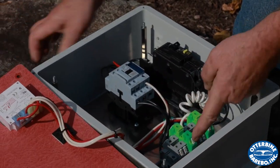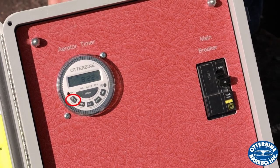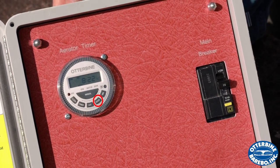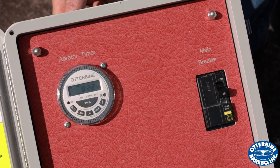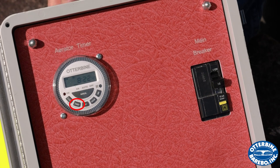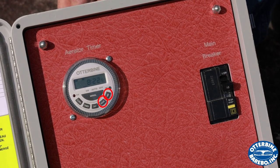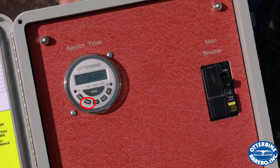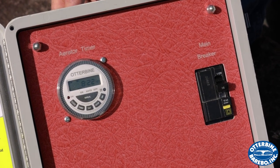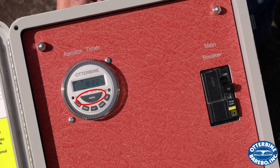The unit seen here has a disconnect option and is what Otterbein recommends. To set the clock, press and hold the clock key, then press the day key to display the correct day. Do the same with the hour and min keys. To set the timer, press the day key and select one of the 15 daily programs. Then press the timer key until it displays one on, and set the turn on time by pressing the hour and min keys. To set the turn off time, press the timer key again to display one off. This can be repeated to save up to 8 daily on/off cycles. To enable the timer, press the manual key until the screen reads auto.